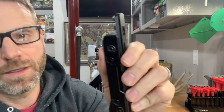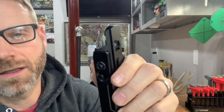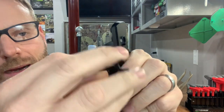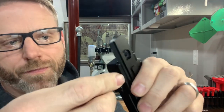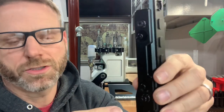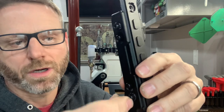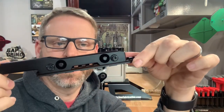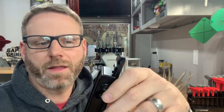Then at that point, take these lock nuts and tighten those back up to the left. Remember, it's backwards thread, so tighten those up to the left. They're just lock nuts, just jam nuts, so you don't have to get crazy kind of torque on them. Just snug those up, and then that is fitted to your rail. So that's good clamping pressure, about a third of a turn.